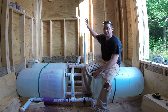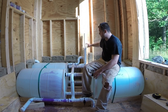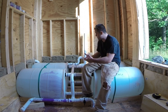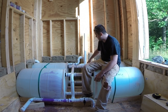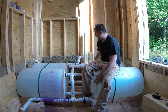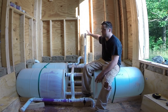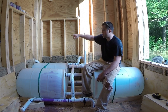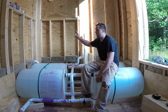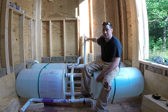If you're going to build a system like this, you want to make sure that your vent pipe is your tallest thing. One thing I noticed is that I might not need this vent pipe because the air can escape right here — there's no trap in it, so the air will flow out. So this could potentially get sealed up later, but for now I'm going to leave it. If you do have a vent pipe, you want to make sure it's taller than your stand pipe, so if the water coming in isn't going out this joint quick enough, it'll overflow on the outside of the house and not on this pipe here.